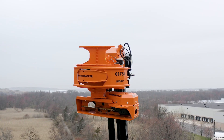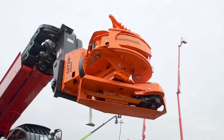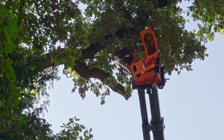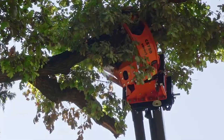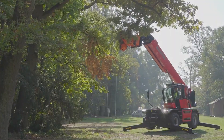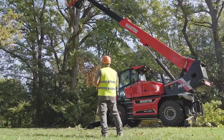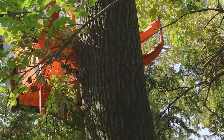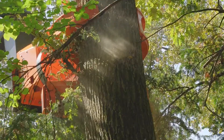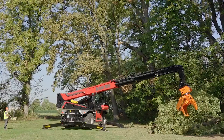We're using a Woodcracker branded grapple saw. There's a grapple on here — it will come grab the tree, and once it's latched on either by pressure or manually, you can operate a saw that'll come out and cut it. Then you can remove the section you just cut, bring it back towards you, and the grapple itself will rotate up to 360 degrees so you can spin it once it's back within a safe operating distance to place it down on the ground for people who are chipping it or cutting it up into smaller pieces.